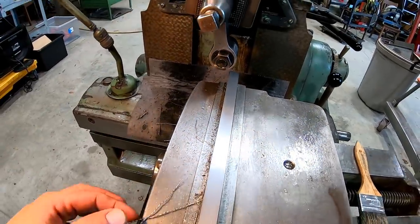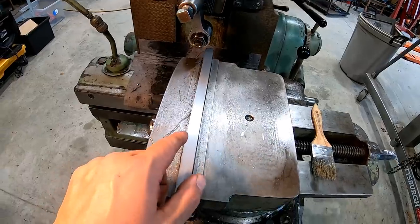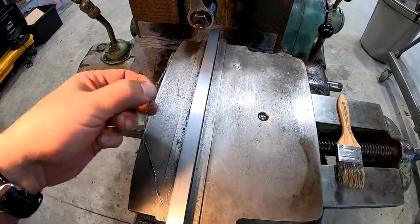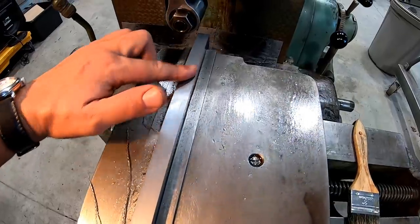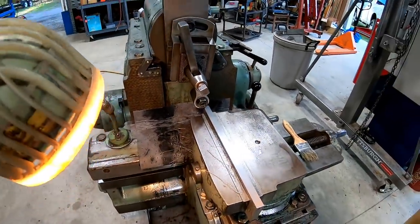That's using our shear tool. This is what the chip looks like. That's just like 2/1000ths. Is that what you took there? 3/1000ths on the last one. 3/1000ths. So this is a 3/1000ths thick chip right there. And it is just beautiful. I mean, it almost looks like a ground finish. It does. It really does. Hard to tell.